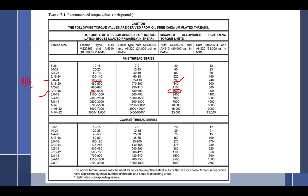Yeah. Now, if it's this particular installation I was thinking of, where students have done this when we build our Lycoming engines, there's this one bolt in the back, and I guess it's a 5/16 24 bolt. But in the service instruction, it also talks about this bolt either comes in this size or it comes in this size. And because everybody's using a 1/2 inch wrench, they key it on the 1/2 inch and then they jump to the 1/2 inch torque. So this is a crankshaft that costs $6,000. And so it should have a torque of 225, but instead they're putting a torque of 1,100.